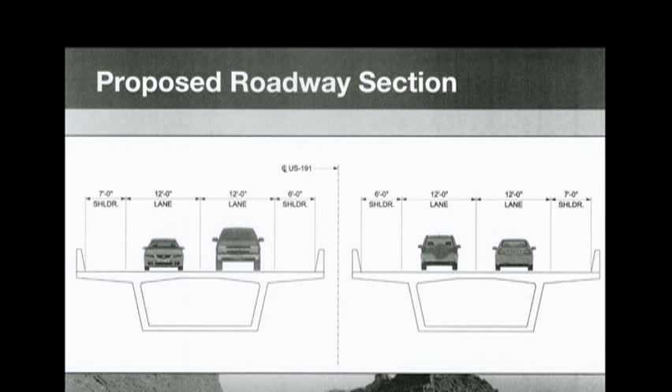This is a unique project because it's called a cast-in-place concrete segmental bridge. What that means is that we take a box girder — basically a trapezoid shape — and we pour the concrete in place one piece at a time. We'll pour a block that's hollow inside, making a box, and then there'll be another box just beyond that. What we've got is basically tendons — a cable system that runs back and forth through these box girders and compresses them together. The combination of the concrete structure and the compression by those cables creates the structure.